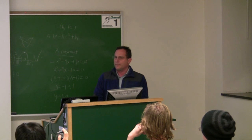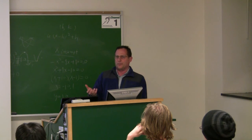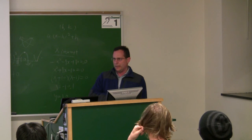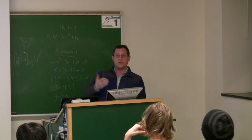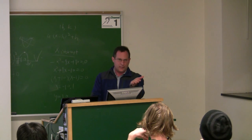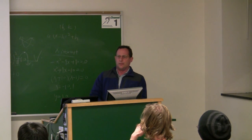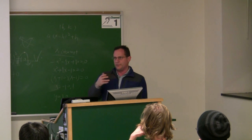So is it the type of capacitor, then? It's the dielectric. It's the way the capacitors are manufactured. The dielectric is polystyrene. People take a mylar film and vapor deposit metal on it, versus using an actual piece of metal in between two pieces of plastic. Some capacitors are huge cylinders, much bigger. You can get an electrolytic capacitor, a tiny little thing, but electrolytic capacitors have different properties associated with them.